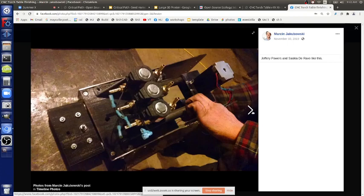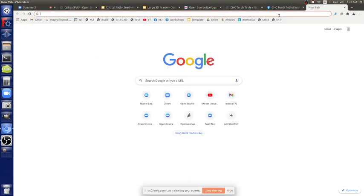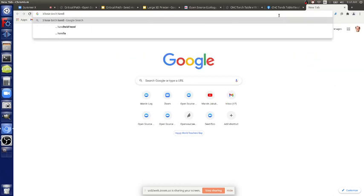So for auto gas control on a torch, you need a three hose torch. So what we did is slice apart, that's all you need, that little tip there, and put three hoses on it and run them through the solenoids. That's a torch, that's it. All you need is a nozzle to send gas through. So you take a torch handle, you have to have a three hose torch handle.